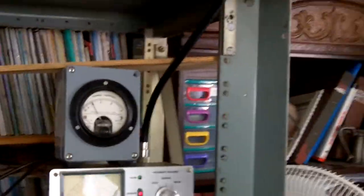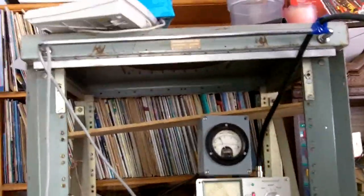You'll see on the thermocouple amp meter that it's about 3 to 3.5 amps of aerial current. Here we've got the 300. VK3JIA testing 160 meters. Come over here and you'll see the 809 modulator meter — the one dancing around is the modulator current, which should be about 150 milliamps. So there's the whole transmitter in action. VK3JIA concluding transmission test complete. Sounds pretty good.